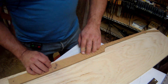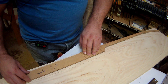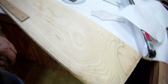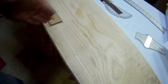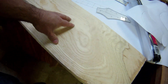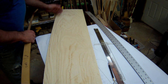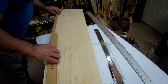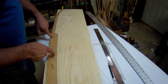So we're going to have a break angle. Really all I'm doing here is just making sure we have enough material to do that break angle, and most of the time it's not going to be much of a deviation anyway. But because this was a distant second candidate, this is some pretty interesting stuff. We're going to chop this off where it is — we still need a back to this thing anyway. Since this is pretty straight, except for a little bit of interesting stuff down here, that's what we're going to take our ash stripe out of. So I'm going to chop this off, rip that, and we'll cut our core out of this.